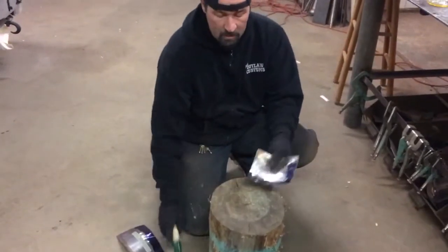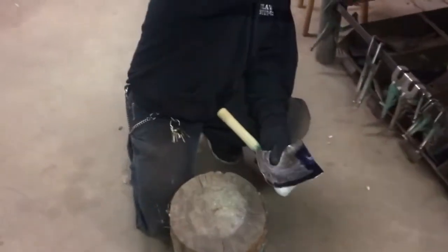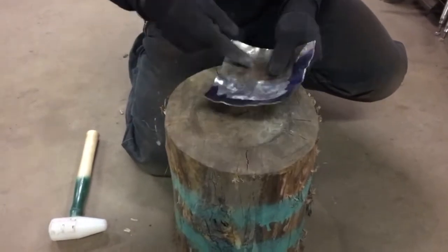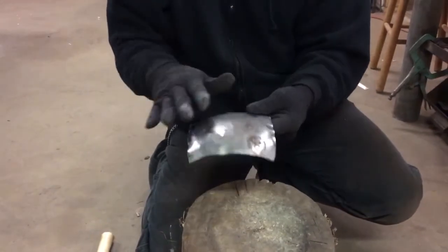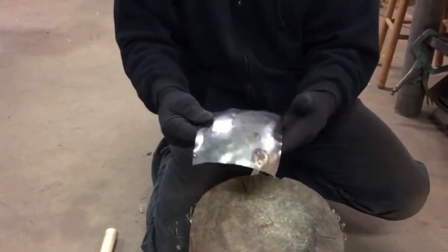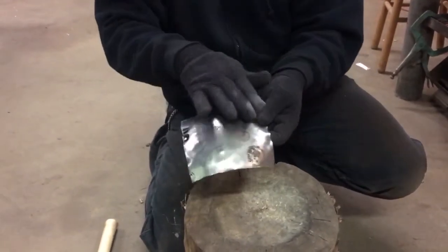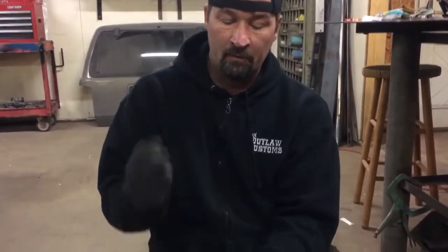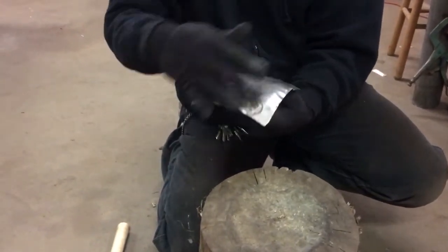And then what you want to do is, once you start taking that piece of metal and beating it up and getting your shape, and you start walking around shrinking it, your metal starts taking its form. As you get the form that you want, you put it in your English wheel or your planishing hammer, and you form it the rest of the way and smooth it out and make it like glass smooth. Or you can take a slapper hammer and a dolly underneath and slap it until it's nice and smooth where you want it.